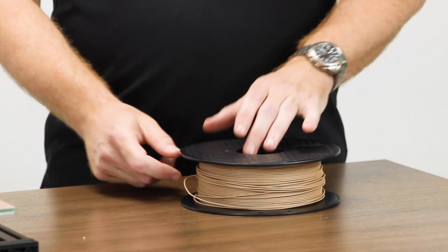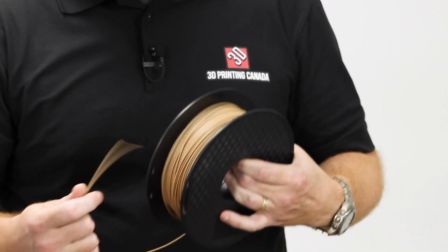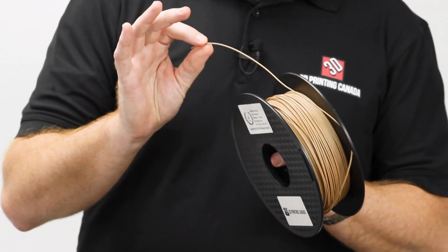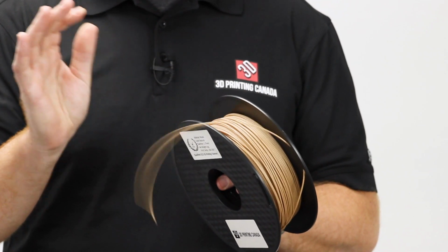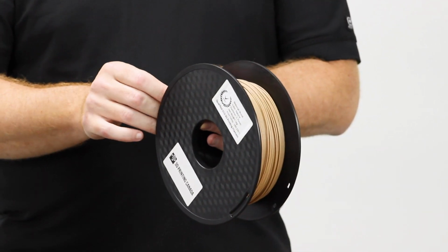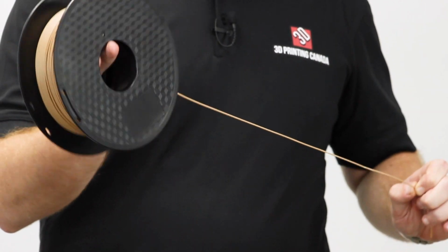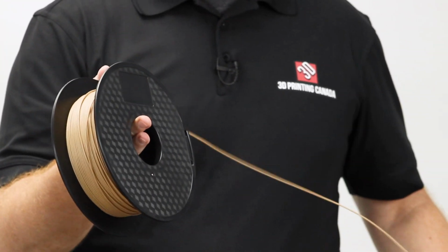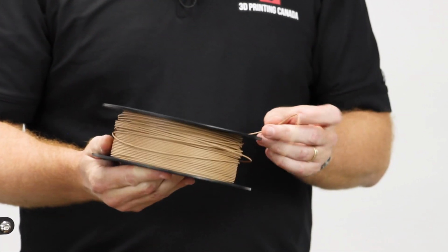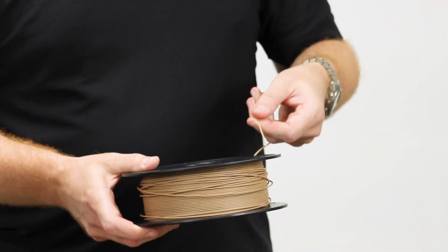Yeah, normally, the best way to ruin a print is to mishandle the spool. So you have this mark here to put the filament on. Be sure when you remove the spool, you're always holding the end of the filament. Don't let it go like that, because for sure it will spool around with the other filaments and cross with other filaments. Then after maybe 20 minutes of printing, it will jam and ruin your print. So it's always important to hold the extremity of your filament, and when you're not using it, just put it back on the appropriate spot right there.